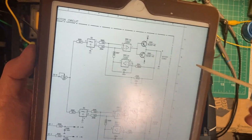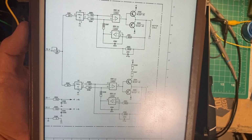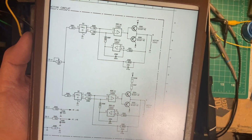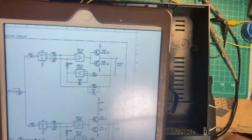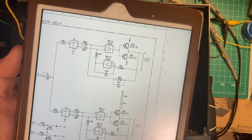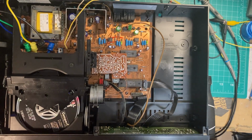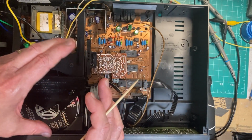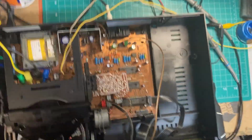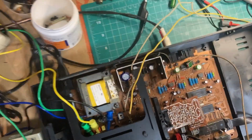So it should be symmetrical. It's not quite symmetrical. I may show an image of that momentarily. Well, it's working, and I'm a little nervous about tinkering with it, to be honest with you. I need to be candid. Even after I had these swapped out, I still had some problems with the unit not wanting to start up. It was kind of jerky and hesitant. It would go doot, doot, doot. So down in here, you'll see 2 potentiometers, variable resistors.